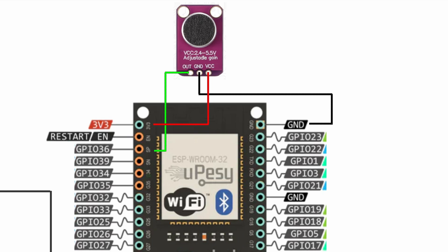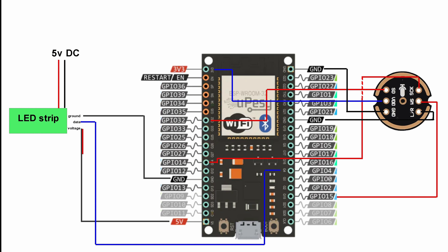I'm going to be honest with you — this microphone is not reliable. Sometimes when you power it up, it doesn't work. It drove me nuts because I couldn't tell if my wiring was wrong or anything. But it turns out it's the microphone — it's unreliable. And even if it works, sometimes it's too temperamental: even if there's no noise, it thinks there's noise, and if there's noise, it might not even pick it up. That's not good.